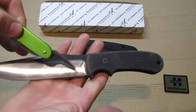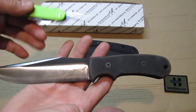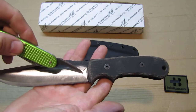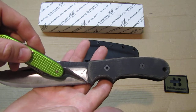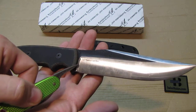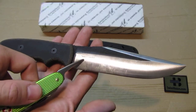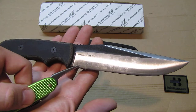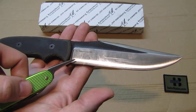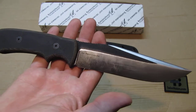The convex edge is really nicely done. We can see here that there's still a bit of paint from the traction coating left — it gives a little rough, ribbed feeling — so I need to rework that a little bit. That was on all the knives I saw, on both sides. We also have a little bit of rust here — it's really not deep, and since it's a user knife it doesn't matter. I'll brush that up a bit with the satin wheel and it'll be good again.